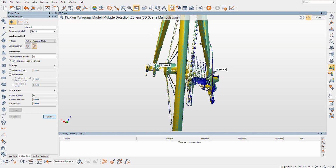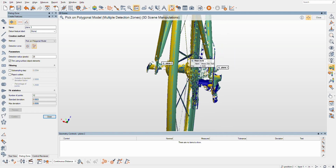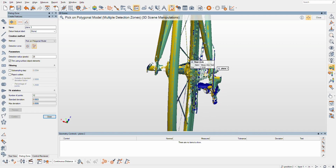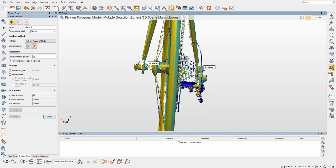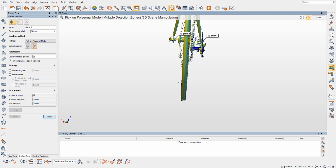When you dish the wheel, the rim is centered on the rear axle, but the spokes are not symmetrically dished. It's called dish of the wheel. Now the front wheel, on this side, the spokes are more out there at a lesser angle than on this side. They're really, really tight. They run straight to the hub, and on this one they splay out more.